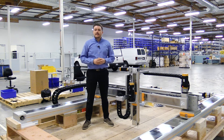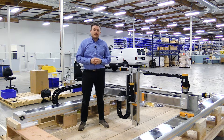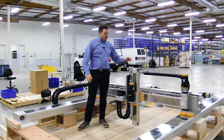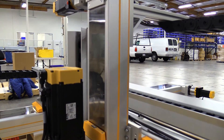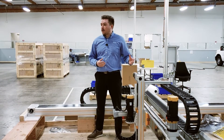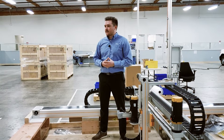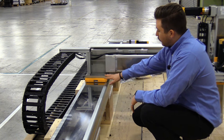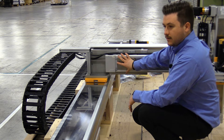What we have here is a five-axis gantry system utilizing Parker Hannifin's HMR belt-driven actuator series. We have sizes 24, 18, and 11 of the series. Valen has sized these actuators specifically for our customer's application. In addition to the mechanics, we have also helped size Parker Hannifin's P-series servo motors along with their PV-series gearboxes. We have the HMRB series size 24 holding a bracket with the HMRB size 18 side-mounted on this bracket.